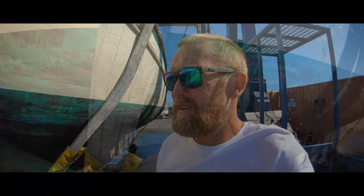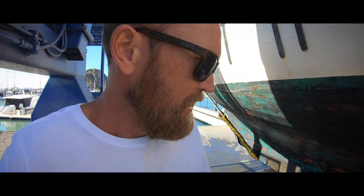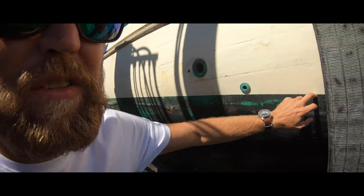So I've got about a week on the hard stand. Pretty straightforward job: flake off some of the anti-foul that's not going to stick, get rid of that, any bare timber we'll primer, mask off the anti-foul line, paint the topsides — two coats — and then a few coats of anti-foul. And then it's back in the water.